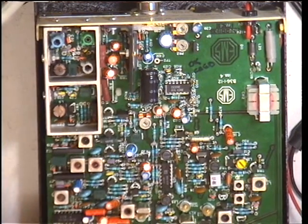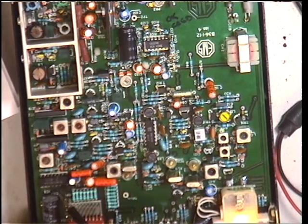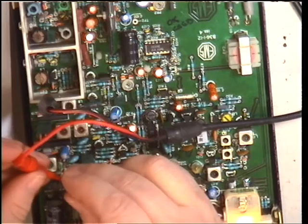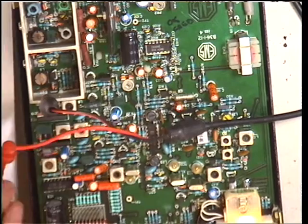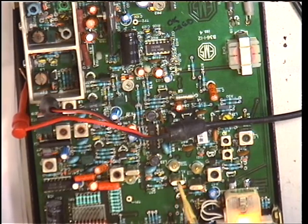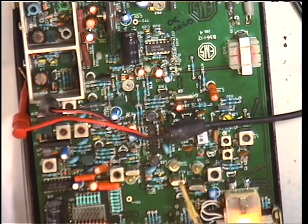What we're going to have to do first is set up the three-crystal synthesizer, which is based on the Motorola MC145109. What we've been able to determine is that the test point — pin 3 of the synthesizer IC — should read 10.24 on your frequency counter. The crystal trimmer TC2 is the 10.24 adjustment; that's the 10.24 crystal. And that's the first thing we need to do to set up this kind of radio.